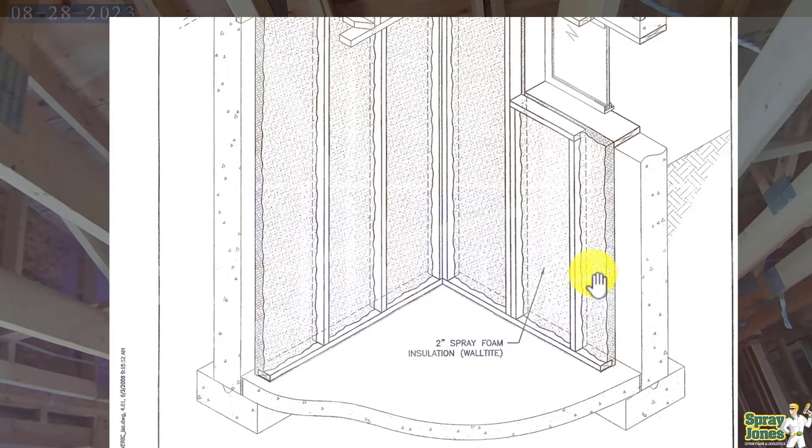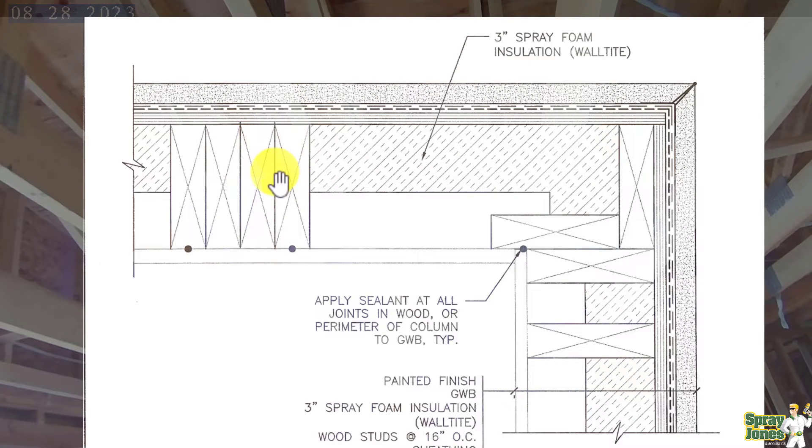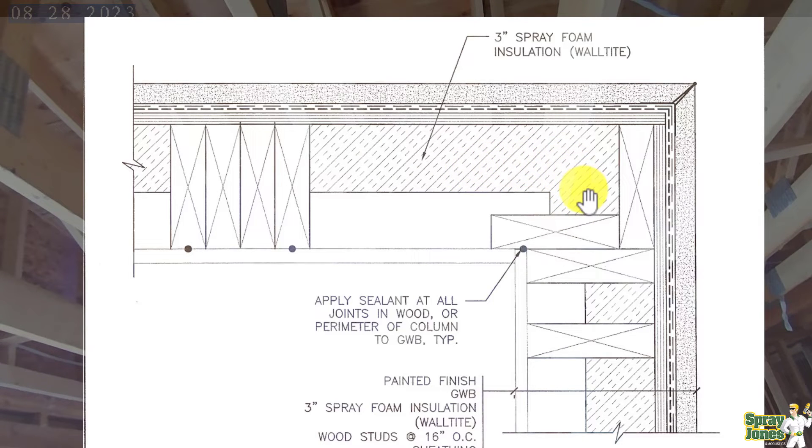Here is a built-up corner detail — this is two-by-six, viewed from the top looking down, with ganged-together lumber. Caulking is shown as a sealant for the assembly; what we do is put it into each of the gaps and cracks, flatten it out, so that air from inside to outside is not bringing moisture with it. With spray foam you're not using poly to try to control any air — which is a joke anyway because you put holes through it when you put the sheetrock on. It's important to get your spray foam consistently into the corner.